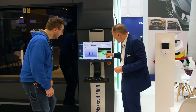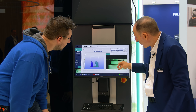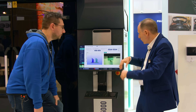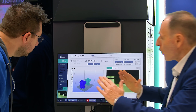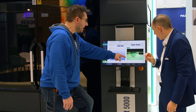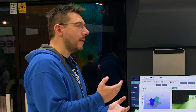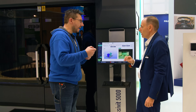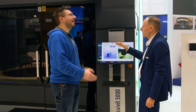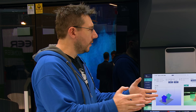If you look carefully over here, you can see the gel — this is the live look at the head moving around and depositing the gel and curing it. Exactly. And if you look carefully, we are printing only the walls, only the closed contour, and there is zero support structure inside. This is the 3D model — you can see we go up like that. It doesn't collapse, it doesn't fall inside, and it's totally hollow. And at the end of the printing process, you just take out the part. The gel is acrylic-based material with good mechanical properties.